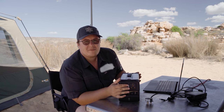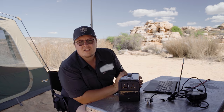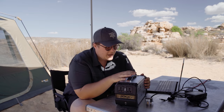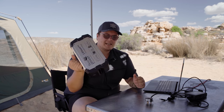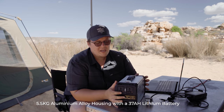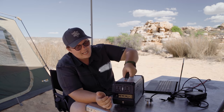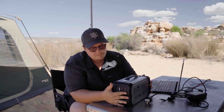It's not too loud when the fan kicks in - it's not distracting or too annoying - but there is a fan that will kick in when it gets hot and when it's under load, especially when it's charging and pushing out at the same time. The battery inside here is a 37 amp hour lithium battery, so it's really lightweight. I'm not too sure on the exact specs but I think it's somewhere between five and seven kilograms - it's impressive in its weight.